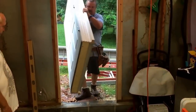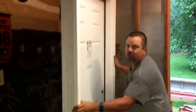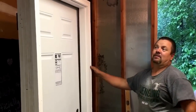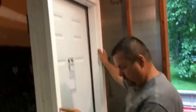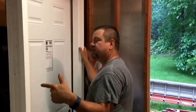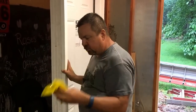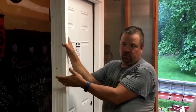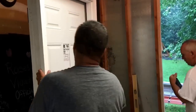Easy — like a glove! I do have a torn rotator cuff, so I probably shouldn't be doing that. Don't play around with jobs like this. As you can see, this lip here that goes on the outside of the door is the brick mold. We'll pre-drill through it and throw three or four-inch galvanized screws through it. Once you open the door, they give you a door pack with brass screws and weather stripping. We'll throw a long screw through each hinge to hold the weight of the door — you don't need to do that on interior hollow-core doors, but exterior doors are heavy and will sag without it.